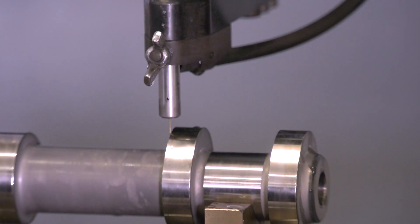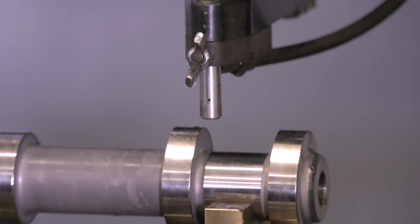Wow. Could you do it any other way? I'm sure there are other ways, but on a conventional machine using a drill — no, that's right. Because you're going in at a tangent, the drill will break. And there's 67 Rockwell hardness, so it just wouldn't work.